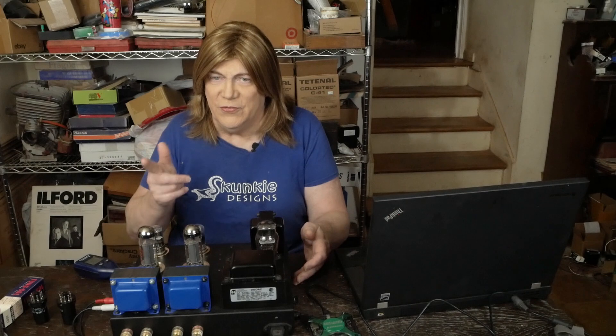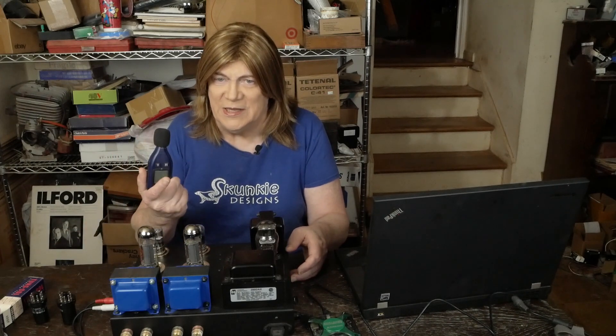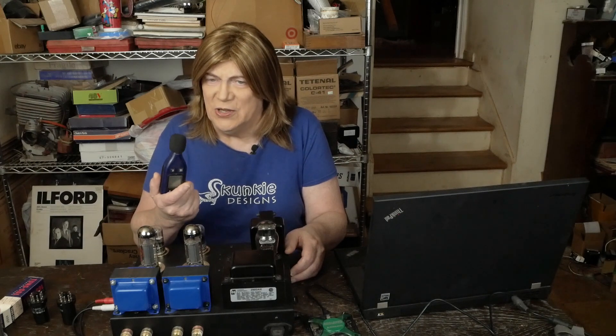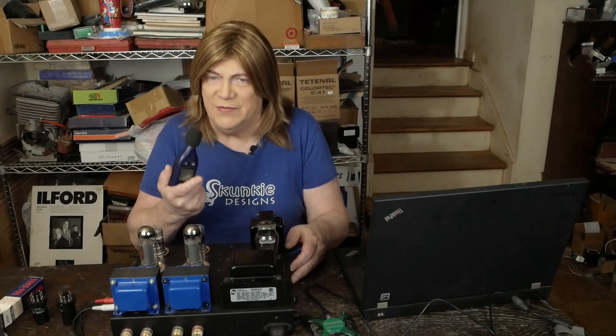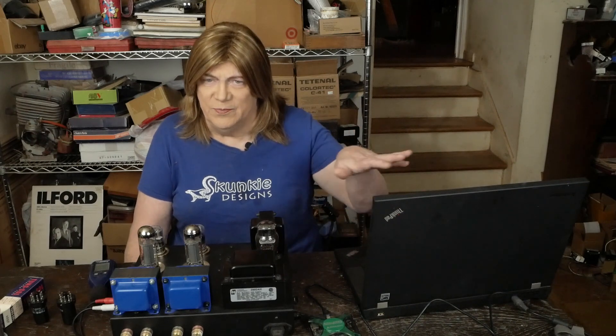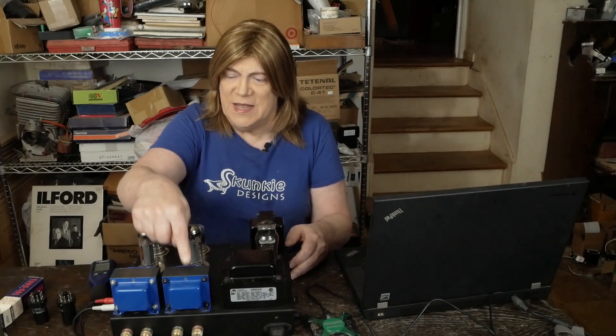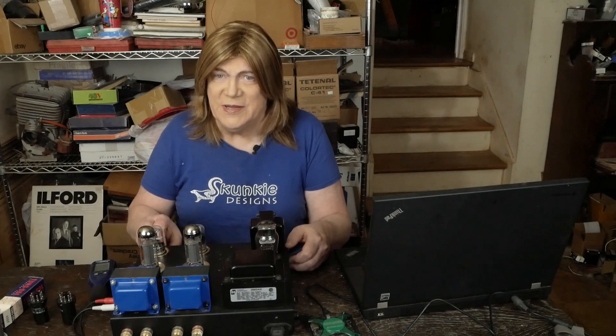The other thing I do is use a little decibel meter from Amazon. I know it's not lab accurate, but it gives a good idea of decibel levels. I tried to equalize the decibel levels between the two samples so I know I'm not being impacted by loudness. I can get it within a dB of each other — so it's not 'that sounds better because it's louder.' I can set it for the max, let one note hit, and look at the max. If they're identical or very close, then I know they're at pretty much the same sound pressure levels. In testing, the 3.5K one definitely makes more power at the same drive — it's a few decibels louder at the same volume knob level, which I expected, and we saw that on the Analog Discovery 2.